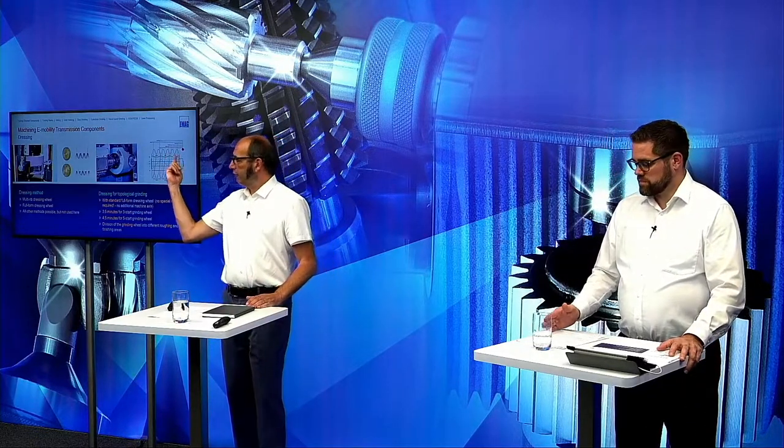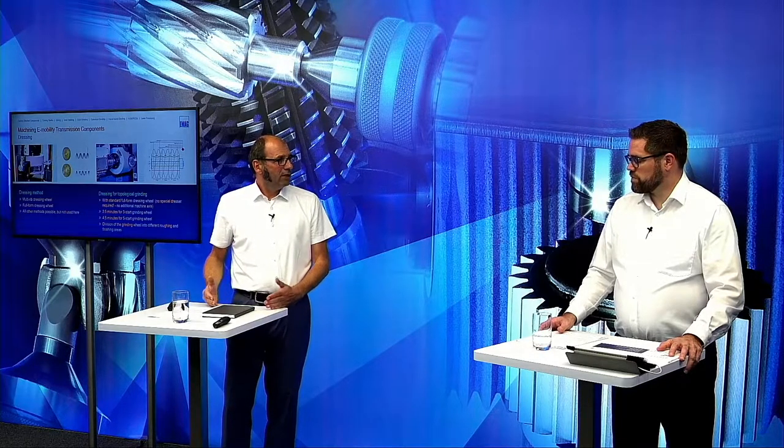But generally, you can say that with topological grinding, the number of parts between dressing is lower than in the standard process, because we are driving every time through the same area, and so we have wear in this sector of the grinding wheel. And when FF alpha and FF beta, for example, increase too much, then we must dress again. So generally, the grinding time and the dressing time is the same in our machine, but the number of parts is lower because of the shifting. Although you cannot do so much shifting as with a standard grinding.